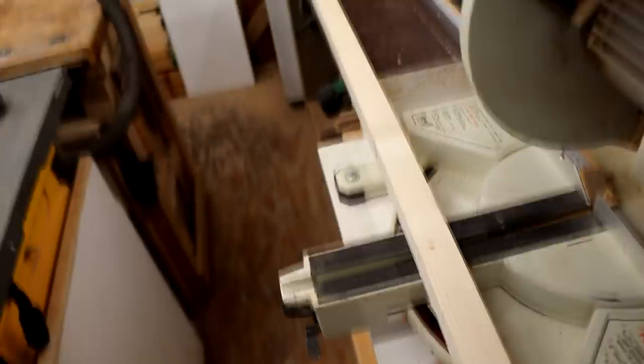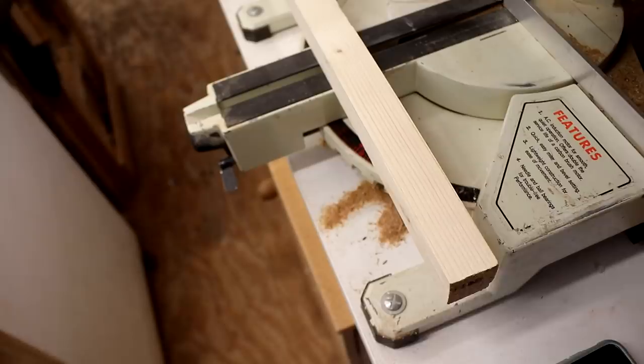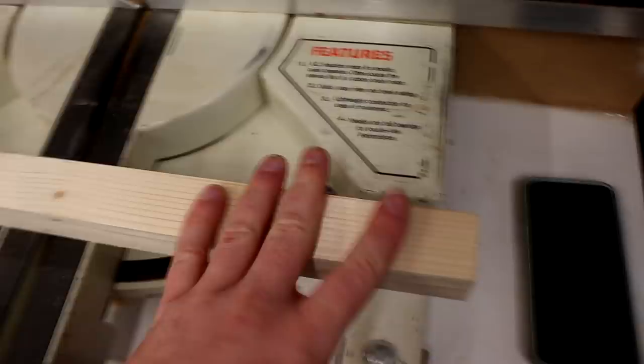So the first thing that I want to do with my pine uprights is pick the straightest lengths, and as you can see, this one here is pretty good. And I also want to pick the cleanest faces, so this face here hasn't really got any knots on it apart from this tiny one here, which I'm not too worried about, so I'm going to choose this as the front face. Next, I want to cut a 10 degree angle to both the top and the bottom, but the problem is I don't have quite enough length at my miter station.